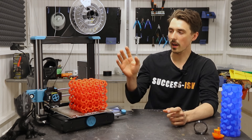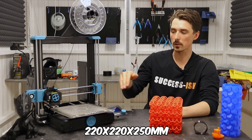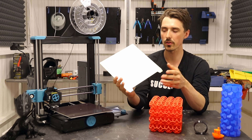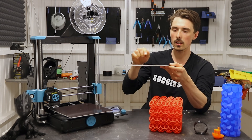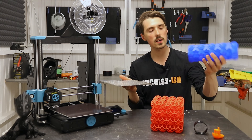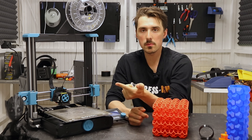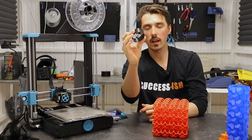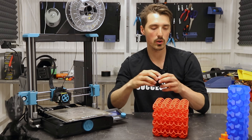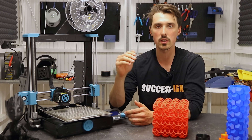I've had this as my daily driver for a couple of weeks now. I've done some test prints and encountered a few things I want to share. The build platform is 220 by 220 millimeters — a decent platform. It has this PEI sheet that's metal and they're supposed to be great, but that hasn't been my experience unfortunately. I had some major issues with warping — it didn't stick all that well to the build plate out of the box. The way I solved it was by spreading one of those glue sticks onto the build plate, and now it sticks like crazy. The extruder I've been really pleased with — it's a direct drive so TPU flexible filaments shouldn't be a problem. I did print a small ring and that was no issue whatsoever. I've tested NinjaFlex, which is one of the most flexible filaments you can buy, and it was no problem for this machine — you just have to go slow.